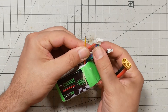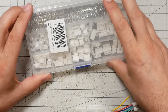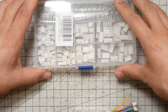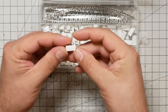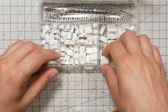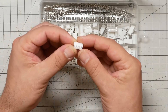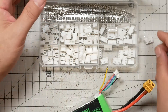So then how do we fix this broken guy? The way we're going to fix it is with this — a balance plug housing replacement kit. It's got a few things in here we don't need, like if we were going to make a brand new balance wire we would use the little crimping piece, but we're not. What we're really interested in is these housings here, which are the exact housing used on the balance connector, and we can just replace the one that's on there.